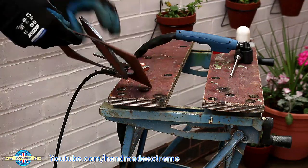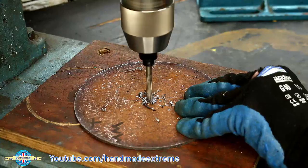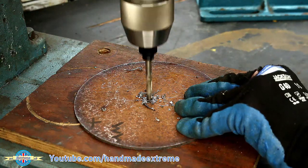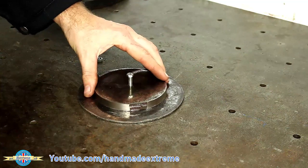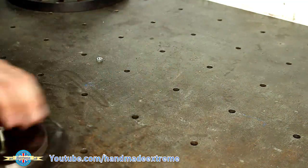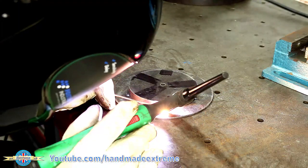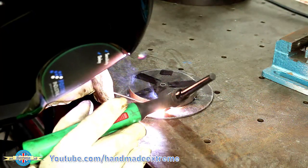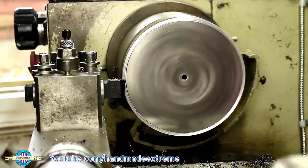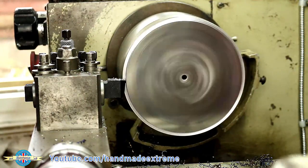Quick tap and out it comes. I could then drill a hole in the middle of that, put the two pieces together with a bolt, a little nut goes on the other side just to hold them together and keep the two pieces concentric, and then a couple of short stitch welds just to hold everything together.